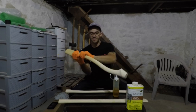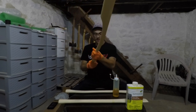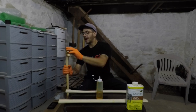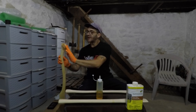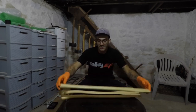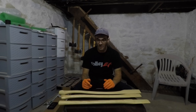Alright guys, same procedure as if you just put a head on it and you're getting ready to use. Nice thin coat of linseed oil — in this case, raw linseed oil. Cover the whole handle, get the end grain. When we're ready to hang a head on these particular handles that we're treating for storage, we're going to have to go back through and do some sanding and shaping the eye and whatnot, but that's okay. So now I got all three handles treated with a light coat of linseed oil. I'll take three axes down and put these up to dry so they're not laying down — I'm going to hang them up.